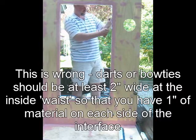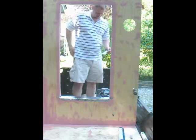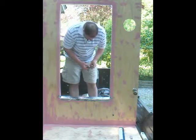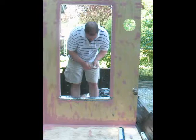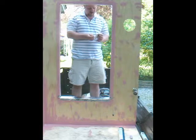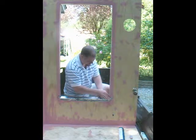I'll make mine a little bit wider. There we go — there's one. And it goes over top of the join right here because that forms a little bit of an opening, and you just want that extra protection. Again, there's R-Guard product below so there's very little chance of water getting through there anyway. This is just multiple layers of protection. As I am going to have this tested at BCIT for my class, I want to make absolutely sure it's not going to leak — my reputation, to a certain extent, is based on that.